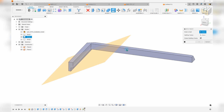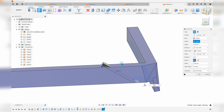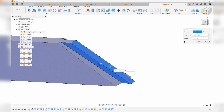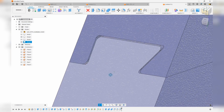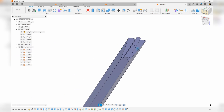This part is larger than the build plate, so we need to make it in several pieces. To connect them I wanted to create a sliding tapered dovetail connection. A dovetail on its own is good, but a tapered dovetail acts like a wedge on each of the mating surfaces, which is going to help keep the joints really tight. In addition, we're also going to create a screw connection directly below that dovetail, and that screw is going to lock the parts down so they cannot come apart at all.